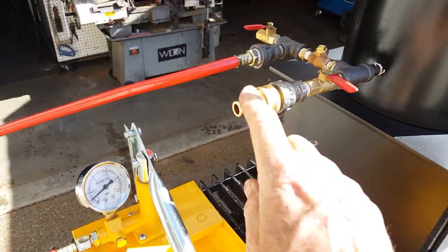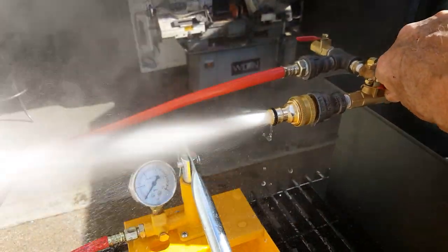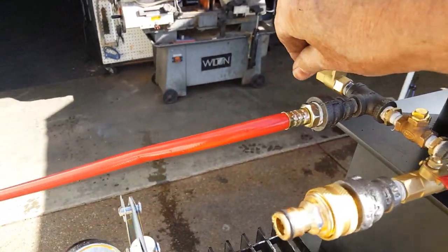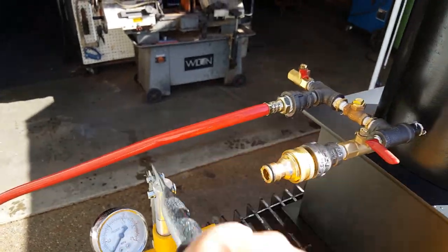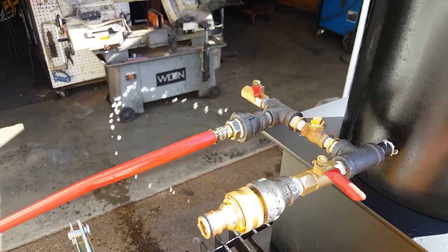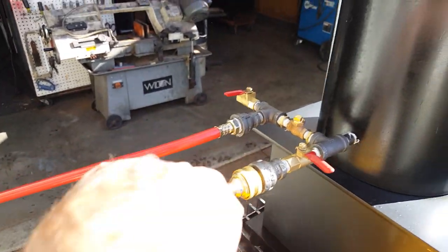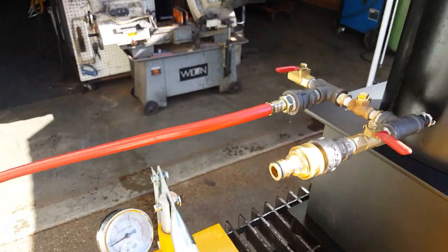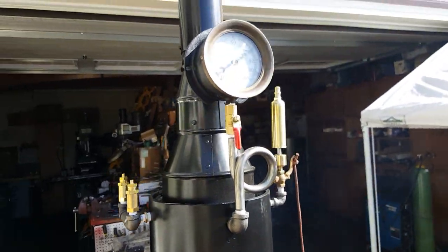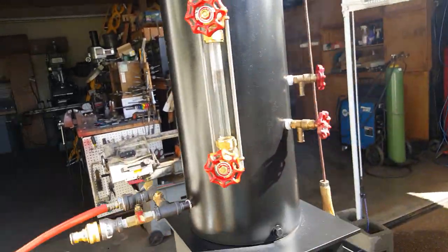This is your blow down valve and fill valve. Once in a while, that's fine. This is the air lock valve for the pump — if you have air in the pump, pump it out. Everything you pump now is in the boiler. The pump off valves are set at about 70 on this one. I can change it if need be, up to 110.